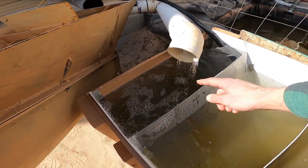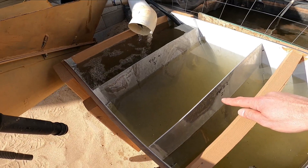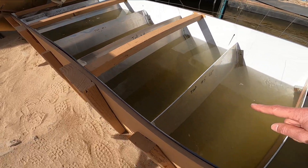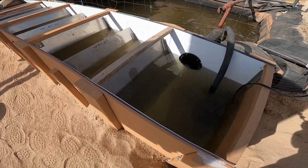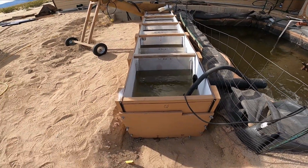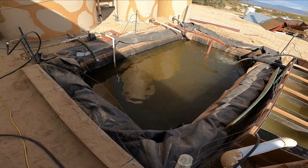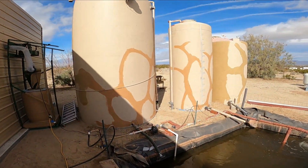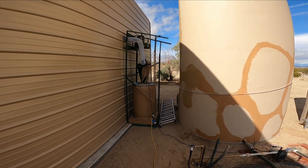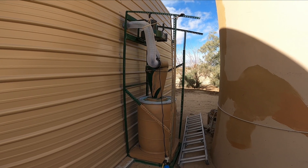In each chamber the water will flow over this first plate, flow under the second plate, over the third, under the fourth, and so on — all the way in each chamber, dropping out silts in here that we'll have to clean out versus our pond. We have 7,000 gallons of storage and this here controls dust from the Stutenroth 2 ton per hour hammer mill.